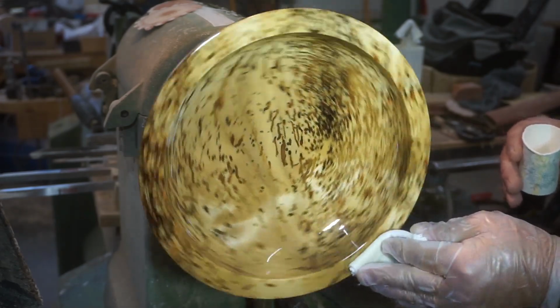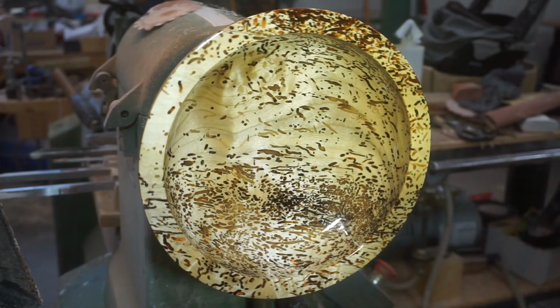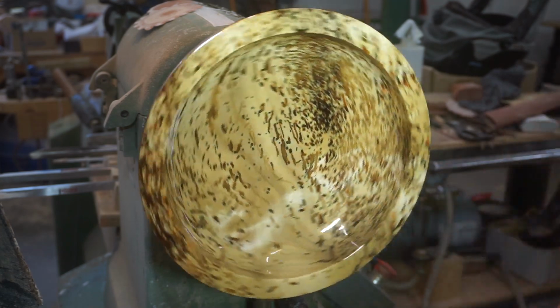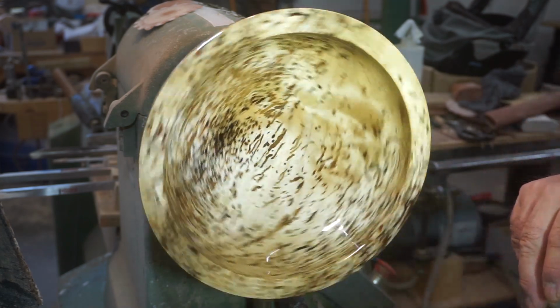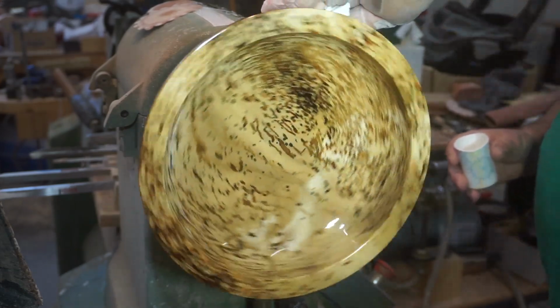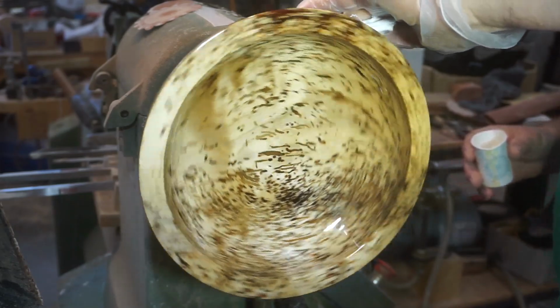And typically you'll get a better shine on harder woods when you use shiny finishes, if you're not aware of that. So we'll see how that is tomorrow, but I suspect that we're probably going to need 3 coats. So I'll do the third coat the same as I did the second, and I'll bring you in when we're doing the foot.